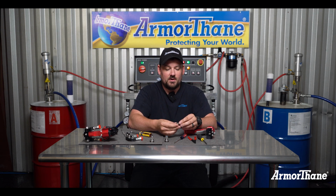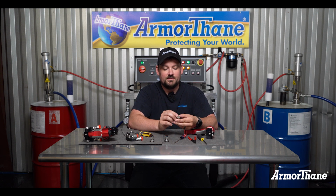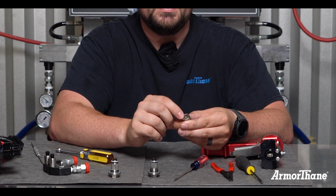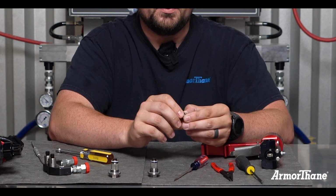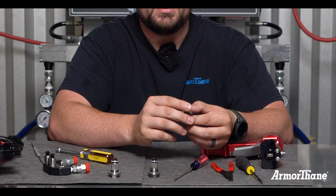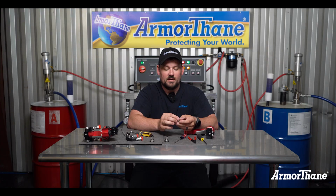It's also important to note that there are drill points on this. So at the end of every day, you want to drill that center hole with your drill bit, and these 4 little outer ones as well. There's also a third size of a drill bit to do these 4 here, which they connect to these smaller ones on the front. But these are at an angle, so you'll want to be careful with your drill bit, especially with the smaller drill bit going in at a proper angle instead of straight in. You can snap that drill bit pretty easily doing that. So you want to be careful while you're doing that.